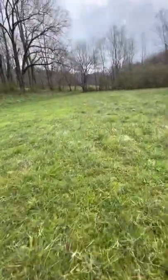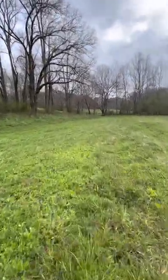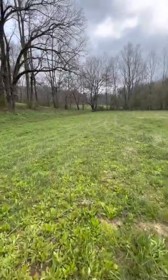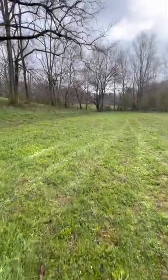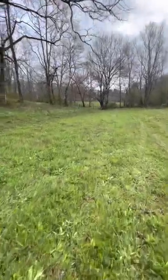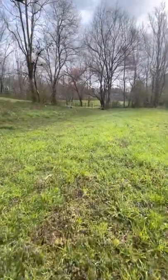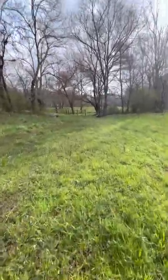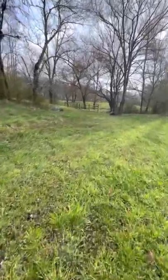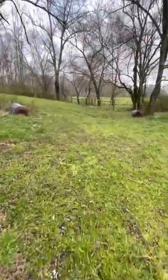Let's go see how we do our gate. The gate needs to be pretty strong, so we're treating it like a corner post on both sides — getting that strength by running bracing back two directions from each side. Even though the gate doesn't weigh that much, it will pull on that post over time, especially if kids lean on it or ride the gate when it swings open. Highly recommend putting in corner bracing on both sides of every gate.